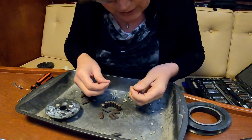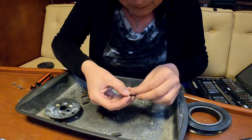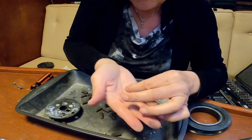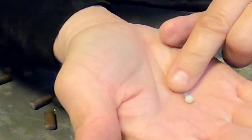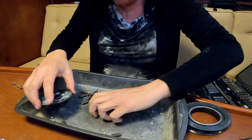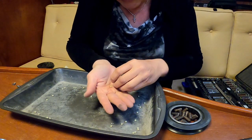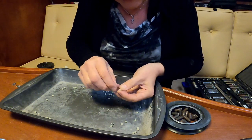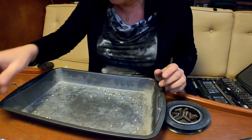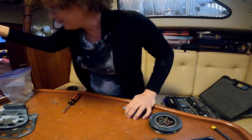And to be honest with you, we actually do have some bearings that are worn. I don't know if the camera's really going to see this, but these two bearings are of a different size. They originally were the same size, but this one is corroded down to almost nothing. So they're out. It's good to have bearings all the same size on each side. Differentials in size are going to be problematic. So we'll install some new bearings. Get rid of these old ones.